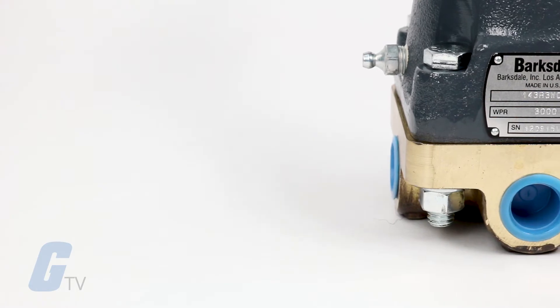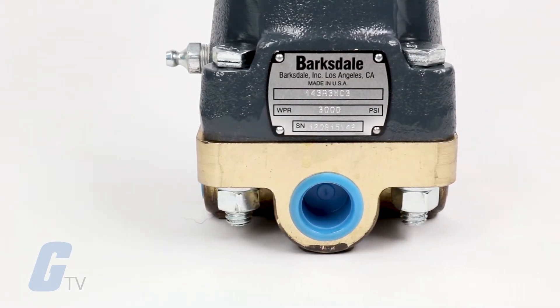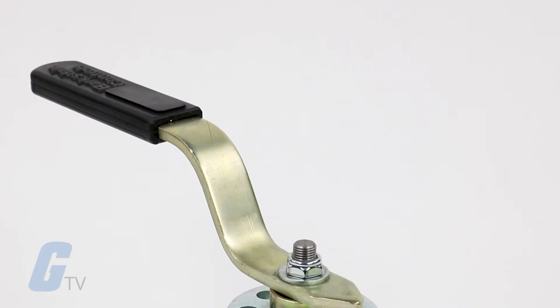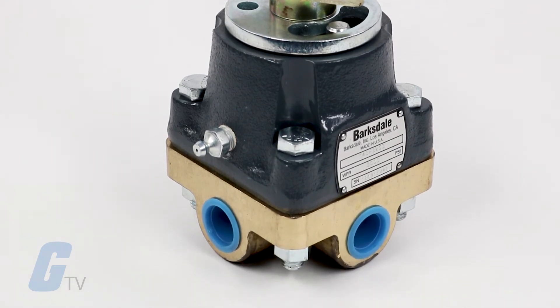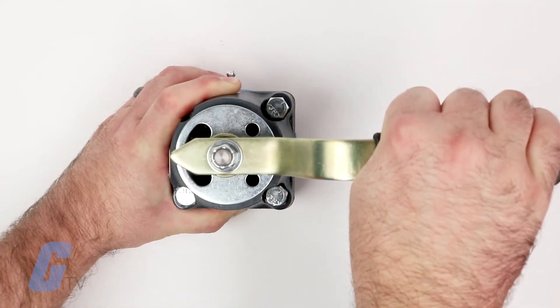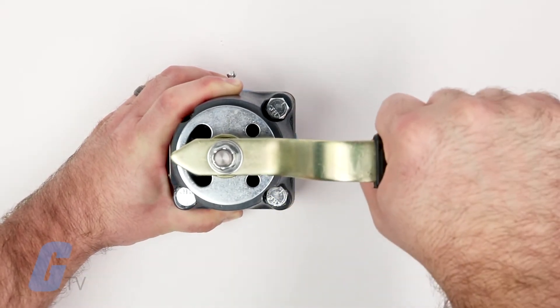This means that metallic particles and other contaminants commonly found in fluid power systems have little opportunity to damage the valve. The continual sliding motion between the shear seal faces and the rotor, along with the combination of spring and pressure loading, allows automatic adjustment of the seals as they wear in. The lapping action between the valve's sealing elements mends minor sealing surface defects with each movement of the handle.